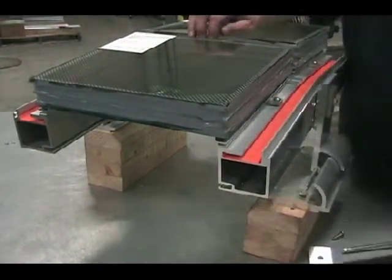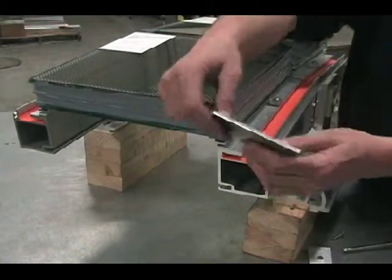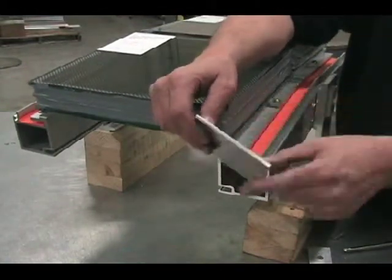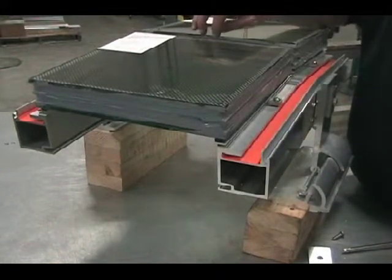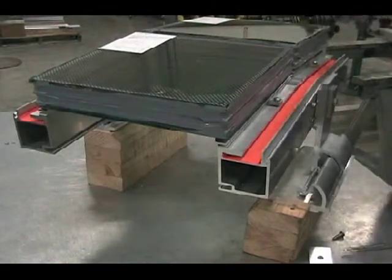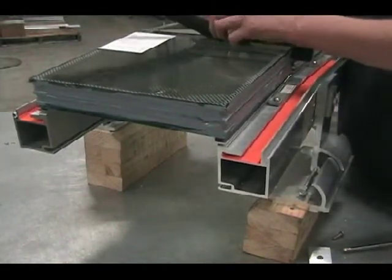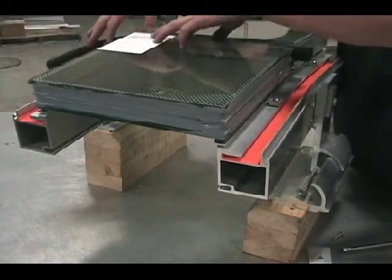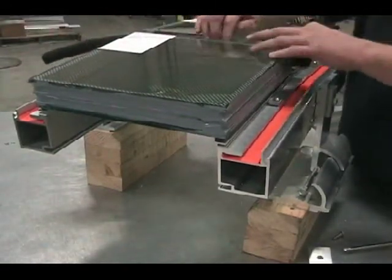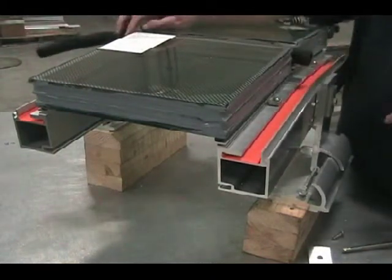The glass stops are set a quarter inch below, and you want to make sure that you put bond breaker tape on the top, because we're just going to leave it be there. And the setting block should sit with it. And when you do the backer rod, hopefully it'll work that you can just pinch it past the glass stop and let it pop back up. And you should have a good quarter inch all the way across without monkeying around too bad.